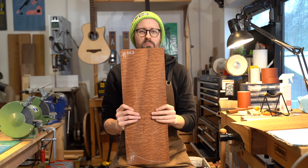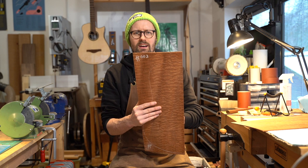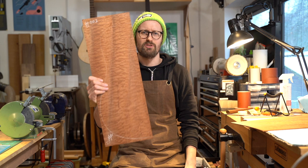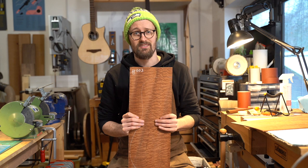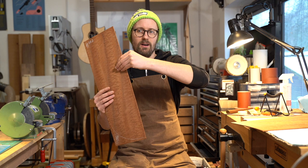In this format, you might think it has no place as a tonewood — it's reasonably lightweight, not particularly hard. We're looking at 0.67 specific gravity and 1,400 pounds-force on the Janka scale. But surprisingly, sapele — and quilted sapele like this — is a really fantastic tonewood, which kind of doesn't make any sense, but let me explain.